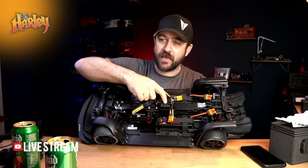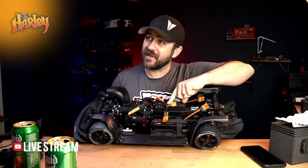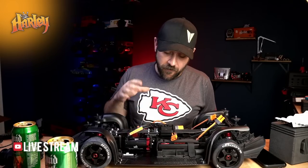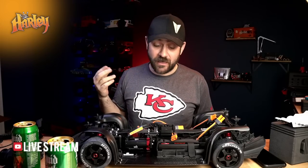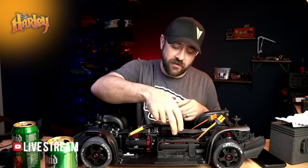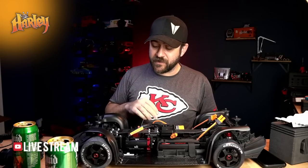And then I designed up a nice clamping mount for the GNSS. And you can still see all the status lights. It's got a proper window around that. And you can still get to the charging point. So we got all that in there. Batteries need to be recharged again because they probably self-discharge themselves because that's what they do. I also, as part of that GNSS mount, incorporated a wire guide for the battery lead that comes from the ESC. So it can still move, but it can't fall down or anything like that. So it just keeps it all more settled.